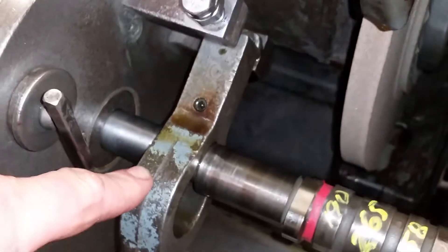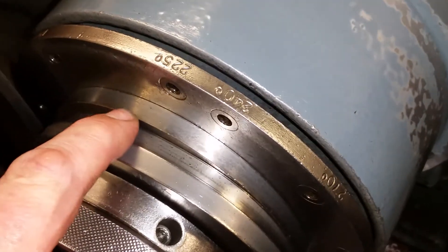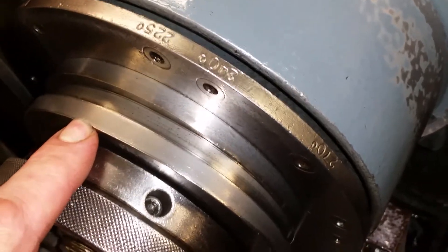There's some numbers I scribbled on there getting the tooling ready. This piece right here is the driver dog that holds the camshaft in the machine. This is the index head right here — you're able to modify and manipulate the lobe separation if required. Over here is the index plate which has the numbers, the firing order of the different banks. And here's where the tooling plates go: this is the intake plate, the exhaust tooling plate, and then the VTEC plate.